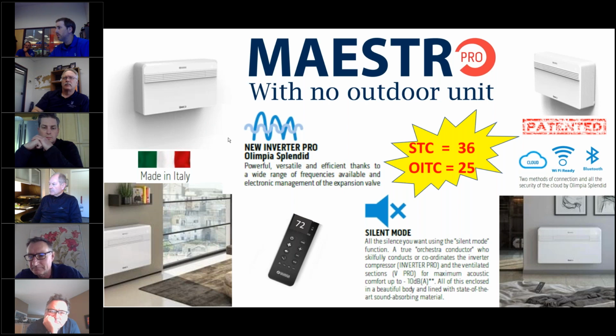If you look at the two values that are up here, STC and OITC, STC is sound transmission class, and OITC is outdoor-indoor transmission class. Those numbers you see there, the 36 and the 25, are the highest numbers achievable. No one can have numbers higher than that. I suppose someday someone might match it, but currently we are the only self-contained unit that can meet those high sound levels. That's a good thing for you to keep in mind when you're talking to folks. In some cities in the US, you can't even sell a unit in that city if it doesn't meet that city's particular criteria for both of those values. So it comes in quite handy.